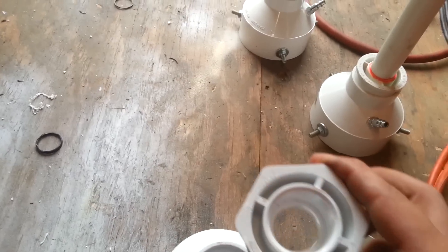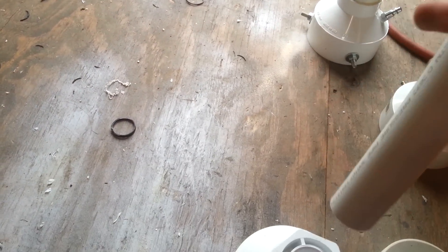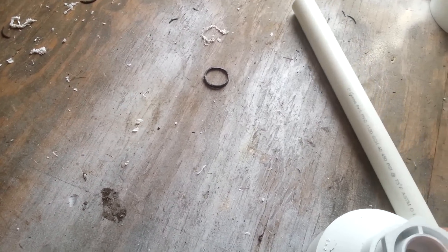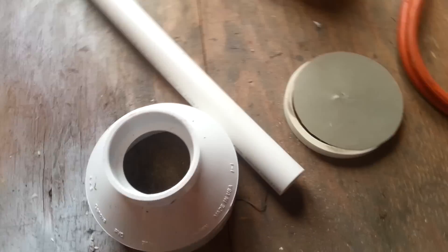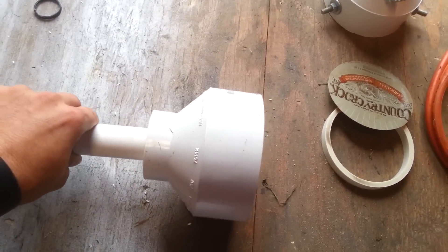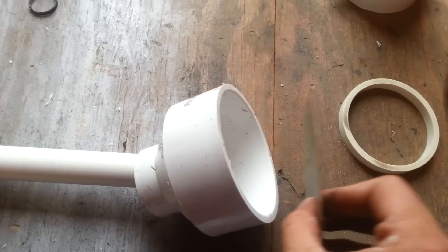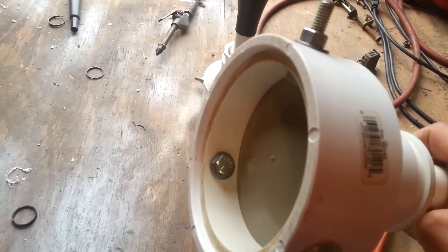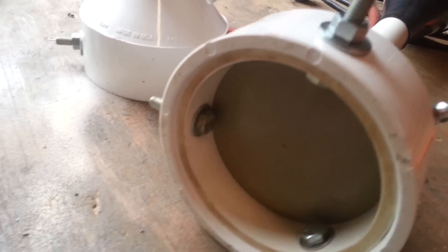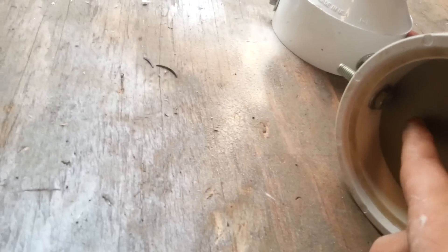Then you take your two-inch to one-inch adapter. There's a little lip on the inside of it — you can see right there — and you're gonna have to get that out so your one-inch pipe can slide all the way through. It'll come out this end and go all the way down inside of here. You can see mine has a little bulge right there where my one-inch pipe is shoved through and hitting my diaphragm, which is this piece.